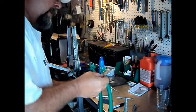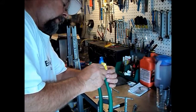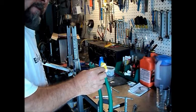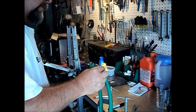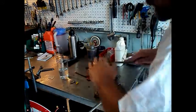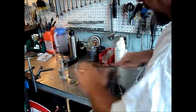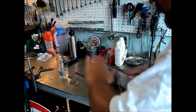We've drawn the shape of the tabs onto a piece of cardboard and transferred it onto flat steel. I've got the flat steel cut to shape, so now we're going to finish them. We've got the two of them clamped together in the vise so that as we file them, they will both take on exactly the same shape.